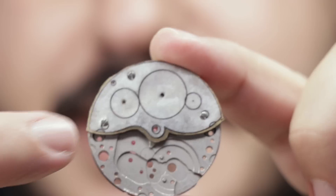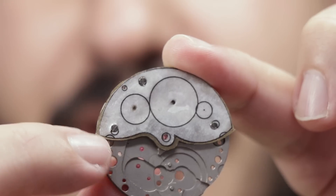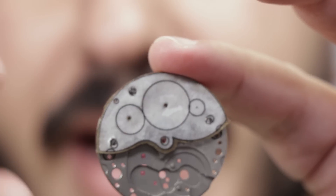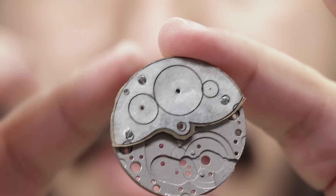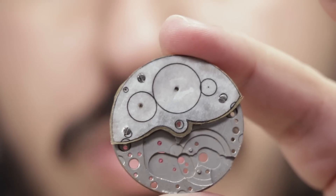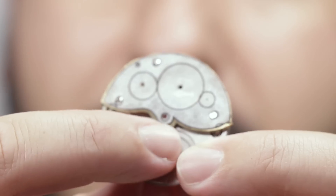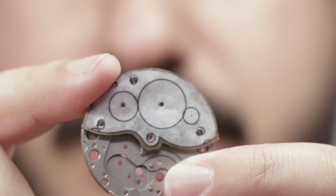This sketch that I have here on this piece of paper is really rough. These holes that I had don't even line up because I drew this off the PDF document in AutoCAD, so it's not very accurate for the hole alignments — I can't use this as a CAD drawing at all. What I'm going to do is file it to its rough shape, then I'm going to ream the hole for the second wheel jewel, then I'll chamfer the outside of the hole, press the jewel in and test to see if it works, and then I'll move on to getting the shape down to its final dimensions. Let's begin.